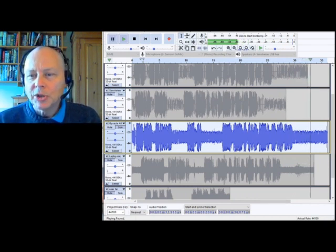Now, to my ear, I can just about hear the whine, the electrical whine in the background there. I'm not sure I'm hearing the hiss. I'm not hearing the raindrops. The quality of the speech that I'm hearing is distorted. I can hear that it's processed, and although this is the same amount of noise reduction as in the Blue Yeti case, here it has to remove a lot more signal because the noise is much higher in amplitude, and that explains why when it gets it slightly wrong, it's reducing a slightly wrong amount of a much bigger signal, and that's what creates the distortion.